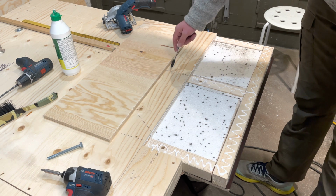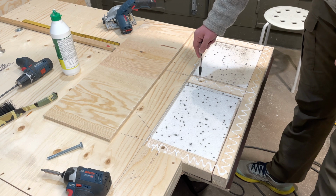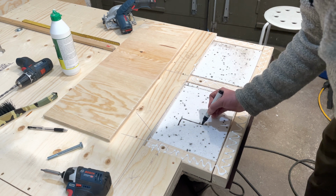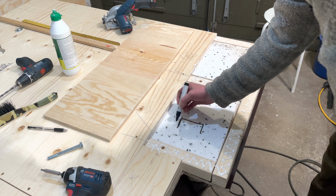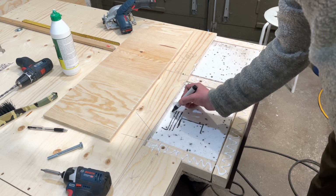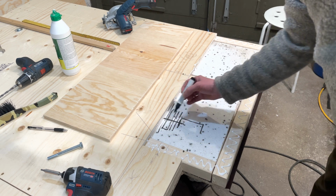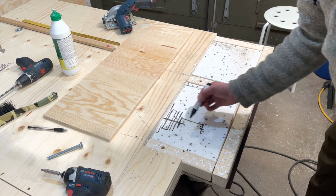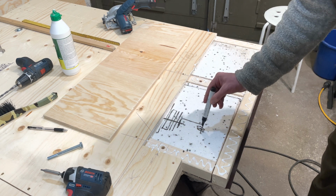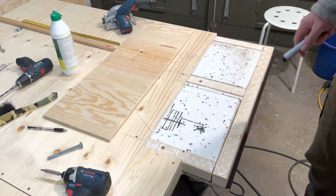And then I did the same from here. I drew a line that goes through the center, and I measured the distance from the edge to the center of the hole. And the reason I cannot drill from the bottom is because the steel frame is C-shaped, and then we have plywood, the thick wooden piece, and then we have plywood again. And it's only drilling through here. There's no hole down here, so I cannot get a drill through in the bottom without drilling out over here. So this way I'm avoiding drilling in the steel frame. So let's work underneath.